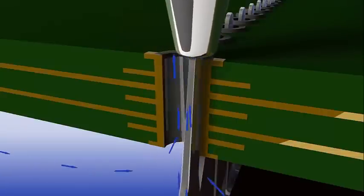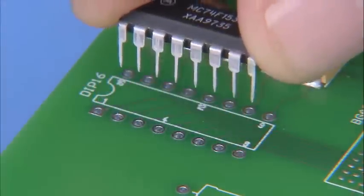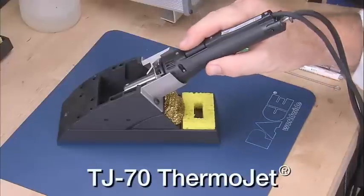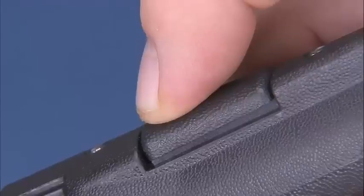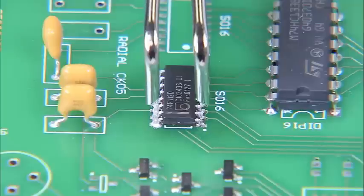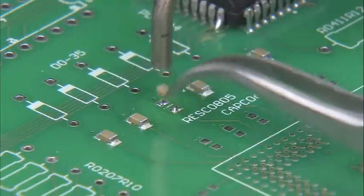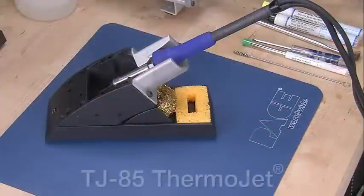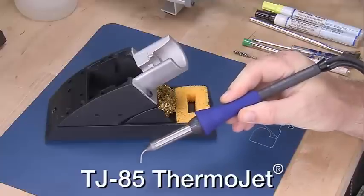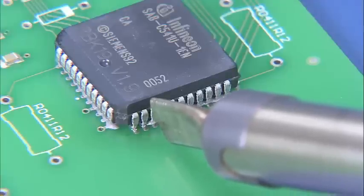Reliability and productivity are dramatically increased. The MBT350's high-resolution pressure control using the TJ70 ThermoJet handpiece offers focused single-point hot air reflow for a wide variety of surface mount installation and removal applications. For more delicate applications, the Slimline TJ85 ThermoJet handpiece provides precise control and access in the tightest places.